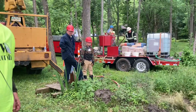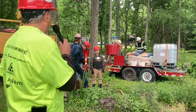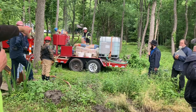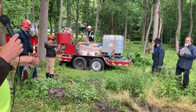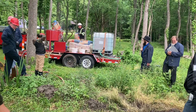So they've stopped the pumping process. We got the one batch down. They're mixing the next batch. You can see water is coming out of the water tank now — we put another 25 gallons of water in the hopper, and we'll mix another four bags of cement. That'll be the next batch to go down.